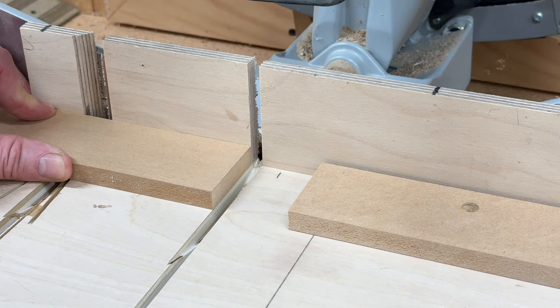This frame will now be filled — I'll use joint compound for the filler. I'll give it two coats of Fresh Start, which is a Benjamin Moore latex acrylic primer. It's heavy bodied, so it hides a lot. If you've worked with MDF, you know it just sucks in that first coat and kind of raises the grain. So after the first coat goes on, sand it, then give it another coat. The last coat is Benjamin Moore Command with a satin finish. It dries very quickly, it's easy to use, and it's a nice durable paint. I've been using Benjamin Moore products for a very long time.